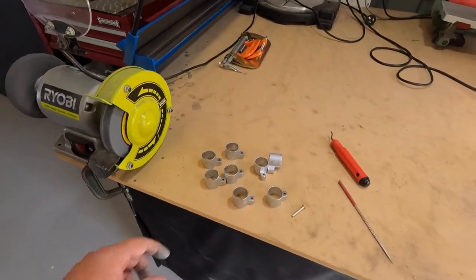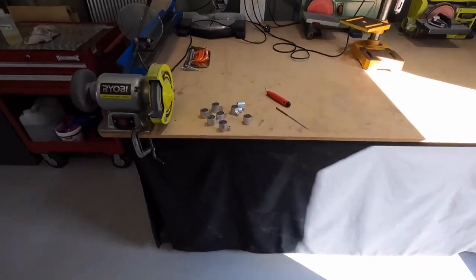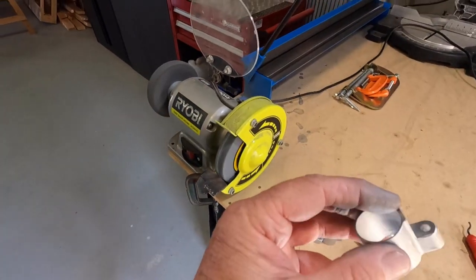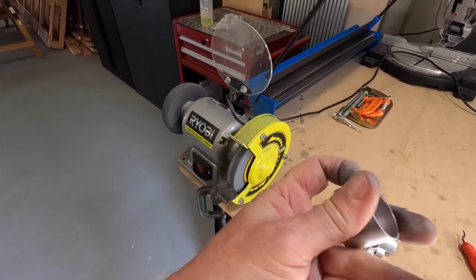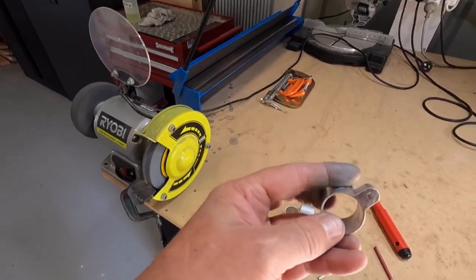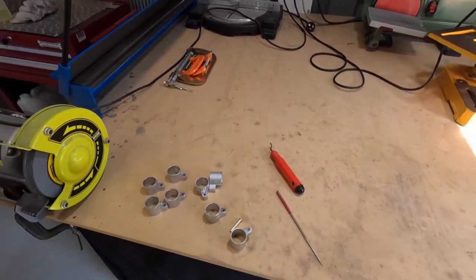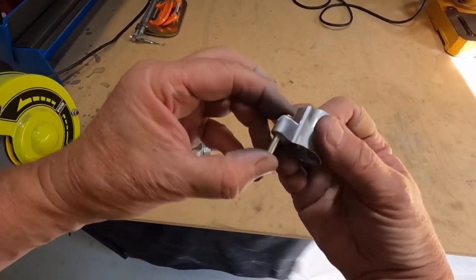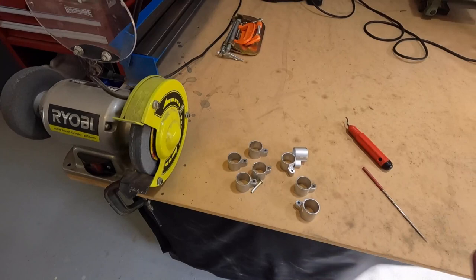mark the spars. All right, so just going through, and this is what takes a bit of time, but I got here at 9 o'clock, it's now 9:30. All the hinges on my buffer wheel, these come sort of rough cut. Clean the burrs off, make them all, I call it a soapy feel, nice and soapy, smooth. They're very rough cut when you get them, and I can feel a burr on that one now actually, and run a needle file through the hole, and then I simply check that the clevis pin actually fits. So if I have any alignment issues later on, it's not the pin, it's an alignment issue.